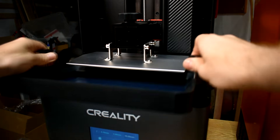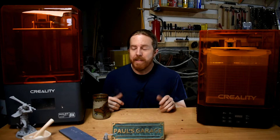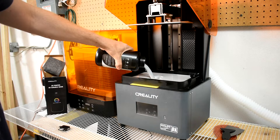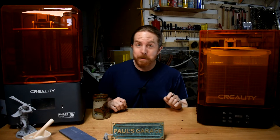The vat — that's where the resin goes. This particular vat has captive screws; you can unscrew them and the screws will not come out, so you can't lose them. This vat can hold a whole bottle of resin, but you've got to make sure the thing sits level on the table or it sloshes to one side and spills are no fun. The resin, by the way, is sticky and smelly.